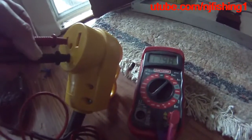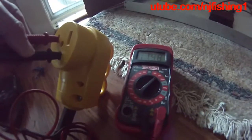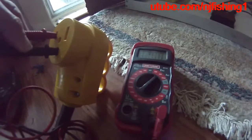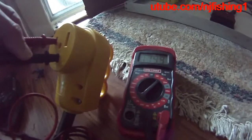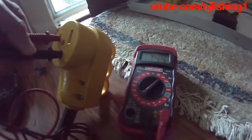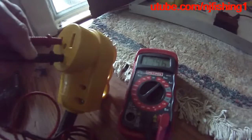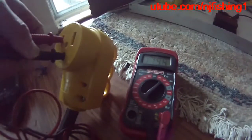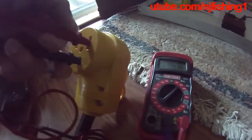So I'm going to check the ground clamp of my welder, and if I still can't get an arc or sparks from my welder, I'm going to have to tear into this welder. The first thing to troubleshoot is making sure you have 220-volt power into the welder, and I do have that — as you can see here, I plugged that in.